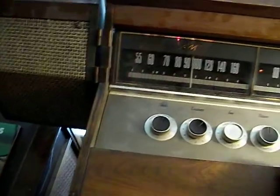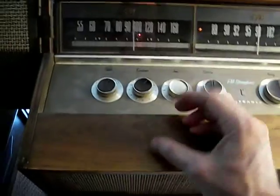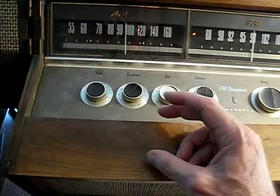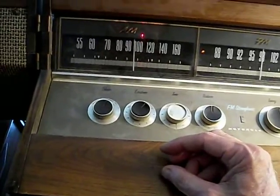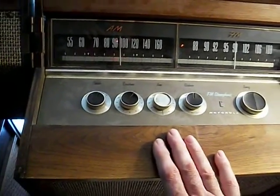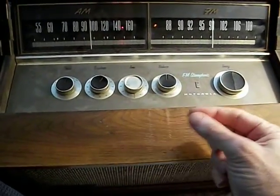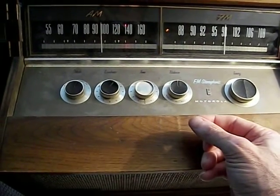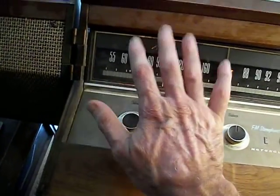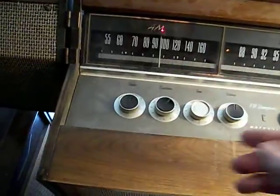It's got a pretty sensitive front end; it uses a line cord antenna. It uses a tuned inductor style tuner on the FM — it's not a variable capacitor, it's actually a tunable inductor. I think it's made in Germany, and it was a commonly used front end on a lot of early tube equipment. It uses a single tube RF amp, a converter, and an oscillator. A little pull string that pulls in and out is how you change the inductor — it's spring loaded. That pull string wraps around a shaft on the back of the variable capacitor. So the variable capacitor for AM only serves to provide a shaft that you can wrap that cord around; the cord pulls the inductor and changes the tuning.